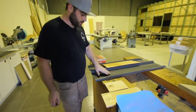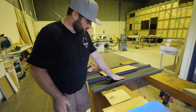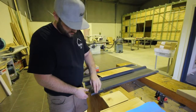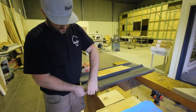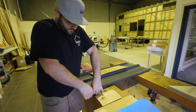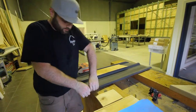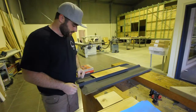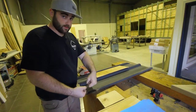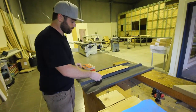On the outside we use this new Colorbond product — it's a matte finish. It's been sitting around so it's got a bit of dust on it, but it's a really gorgeous finish in the sun; it looks like slate or stone. The steel used for Colorbond roofing and cladding is not a mild steel — it's a very hard steel, so it's relatively thin and light but really very strong. To bend it takes quite a bit of force. Old corrugated iron you'd find on old sheds is a lot easier to bend — this modern stuff is really stiff and strong.